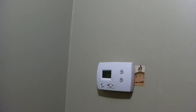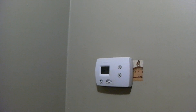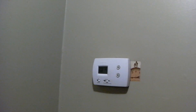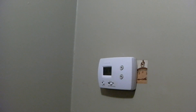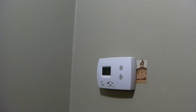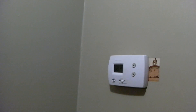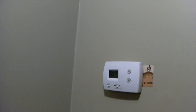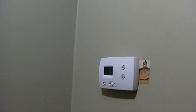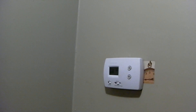When the heat pump runs, normally your auxiliary heat is not running unless the unit defrosts or you get cold inside and turn the thermostat up. So when it does eventually try to use the aux heat on its own, you'll notice a burning smell in the house. This will eliminate that, and also it'll ensure that your backup heat does work — in the event that it gets too cold outside or your heat pump fails.